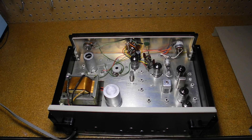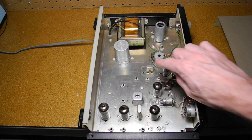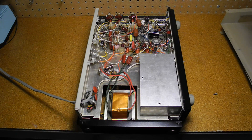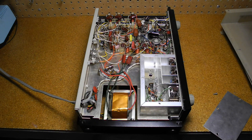Taking a look inside, all circuitry is point-to-point using a metal chassis, tube sockets, and terminal strips. The unit uses six vacuum tubes: a 12AT7, 6AU8, 6AN8, and three 12AU7s. The RF oscillator modulator tube is shielded. At the top you can see the tubes, power transformer, and filter cap — note the magnetically shielded power transformer. A lamp is used as a negative resistance device in the audio oscillator, which utilizes a Wien bridge circuit; the lamp doesn't light during operation. The large crystal is for 19 kilohertz and the smaller one is for 5.35 megahertz. There are trimmer caps and coils accessible for alignment, and a shielded compartment around the RF oscillator with separate shielding between each of the attenuator switches.